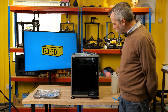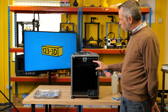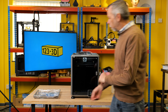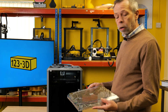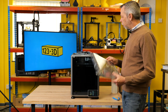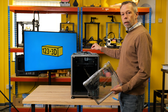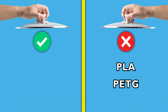The extruder is holding to the side and now it's going to complete the auto leveling. Basically the nozzle will probe all over the bed and generate a bed mesh. The build plate has strain gauges built into it, so it can measure the pressure to know when the nozzle actually touches the build plate. A couple of things I see beginners struggle with: the lid. A lot of people think because it comes with a lid you use the printer with the lid on. The lid is only meant to be used when you want to control the chamber temperature. For PLA you do not want the lid on — it causes the chamber to get too hot, the PLA becomes soft in the Bowden tube to the point where the extruder gears won't grip it, and you end up with a failed print. So: PLA no lid, PETG no lid. The only time you want the lid on is when printing with ABS or ASA.